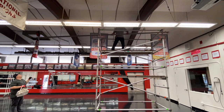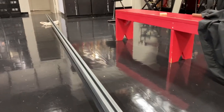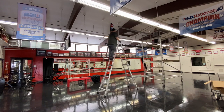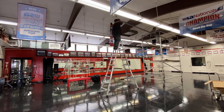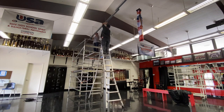The SNK team is taking down the rest of the track and re-securing the hang points. We are installing a brand new 2800 box channel track at a 60-foot span. We set up three 20-foot track channels and spliced them together to cover the 60-foot room span. We then reinforced each hang point and added one more to make sure the track was nice and secure.